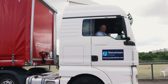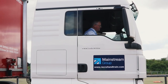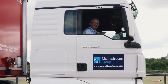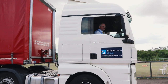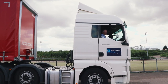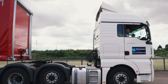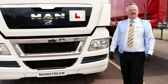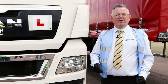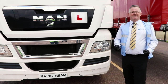You may have to build up some air pressure because you disconnected the emergency airline. Once the air pressure has built up, select the low gear, release the handbrake, and drive forward slowly under control. Then I would say to the examiner, I'll go to the rear of the trailer and remove the number plate. 99 times out of 100, the examiner will say that's okay, we are going to pick that trailer up. If they don't, then you need to remove the number plate and stow it safely in the cab. And then you have completed the uncoupling exercise.